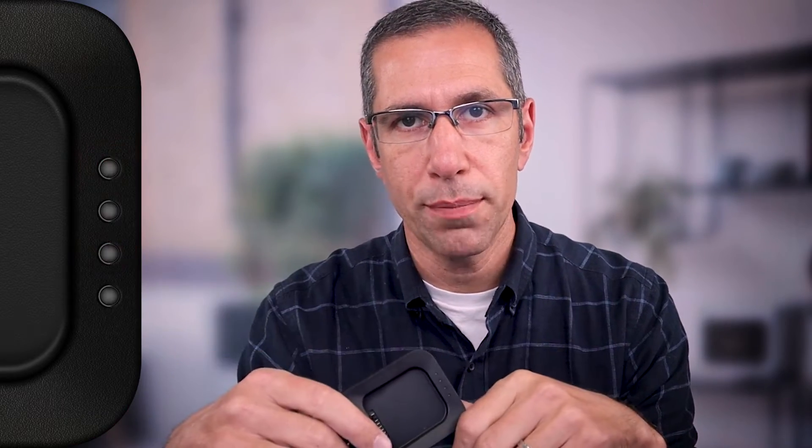If you see that the lights are white, red, white, red in that pattern, then you know that the voltage is incorrect and you need to change the power brick being used. If all four lights are flashing from white to red and back, it's a temporary failure — the battery could be either too hot or too cold, but it is not a permanent malfunction. You just need to cool down or warm up the battery and try again. Finally, if you see all four lights are red and flashing, this is a permanent failure and the battery needs to be replaced.